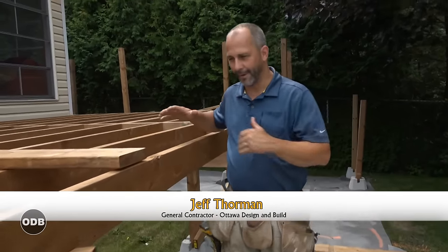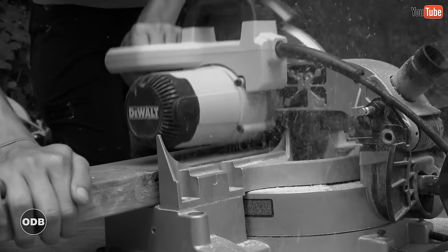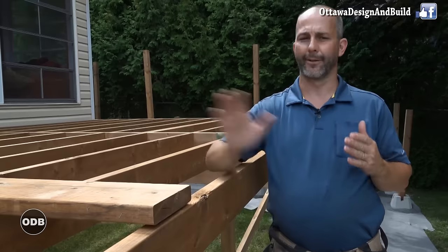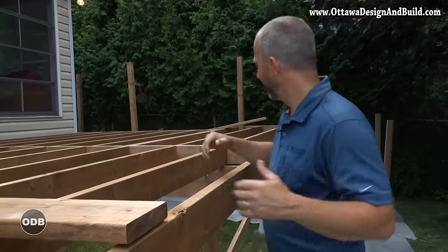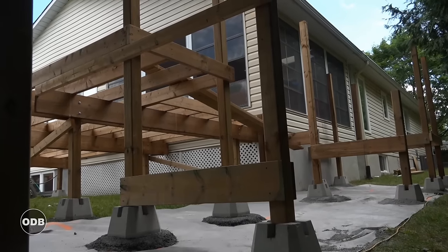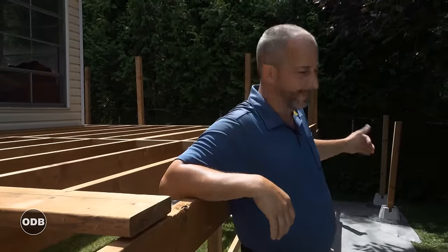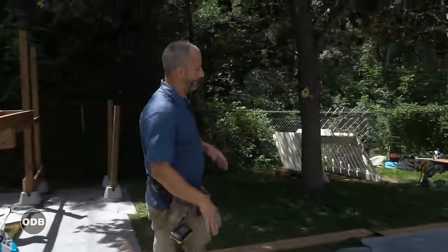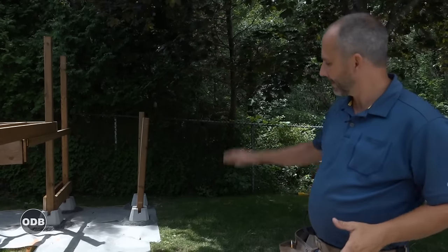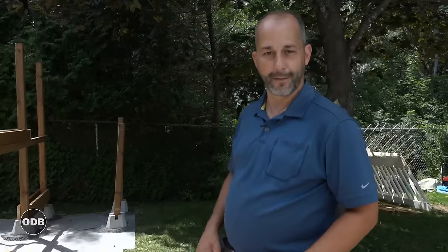Last time we were visiting, we were working on the platform of the upper section of the deck — that section is basically finished. They're going to put a little angle on it to mimic the pool, nice for the barbecue area. Today we worked on the wheelchair accessibility ramp — they have the platform there with all those posts in the background. Before we can finish our deck and ramp, we really need to get this lower platform finished. We're laying our landscape cloth using building materials right off the shelf — 10 foot lumber, 24 feet long, just a great big rectangle. We'll put a little bit of structural support underneath, get rid of the bounce, and then we can line up for where our stairs and ramp end. Then we've got a call for inspection.